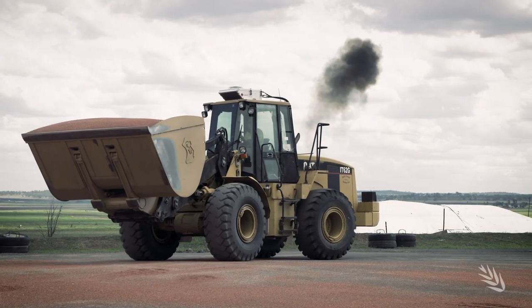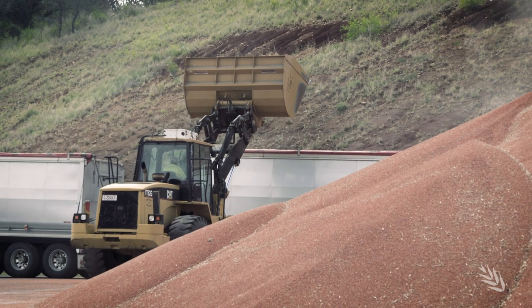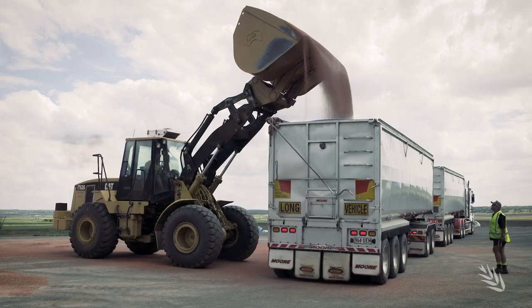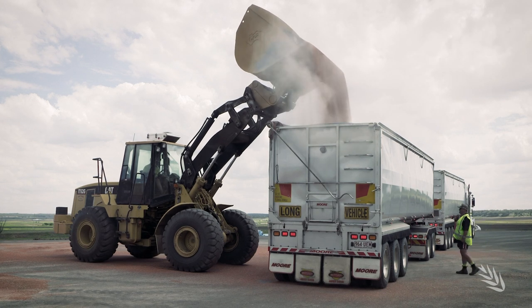Next, site preparation — crucial to end up with a successful bunker. We need a source of extra fill material to build up the drainage for the pad. We definitely need that well compacted. We don't want to have damage to the site when we're bringing machinery in and out — trucks etc. — onto that actual pad. So it needs to be well compacted and well shaped.